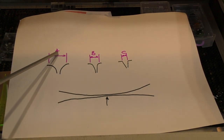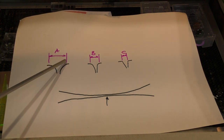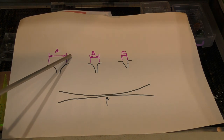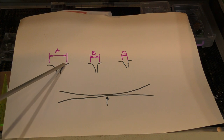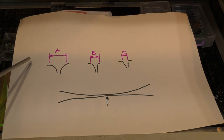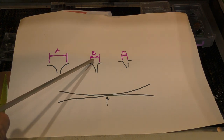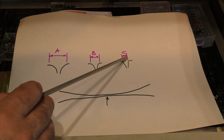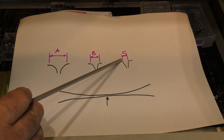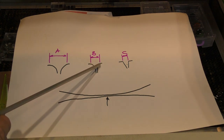But at the same time, when we were out of focus, we were getting the additional low intensity rays at the outer part of the beam, causing this radiusing, damaging, scorching effect on the edge of our cut. And that scorching effect got less and less as we got closer to what we thought would be the focal point. And here it is. We've got a nice sharp corner. We've no longer got radiused corners.